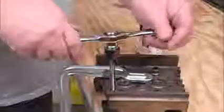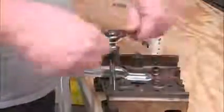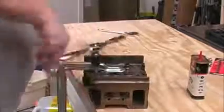After clearing the hole to make sure there's no debris in that, I can use the included tap to start cutting the threads. These taps may be cutting special threads for these inserts, but you use them like anything else. Go 1/2 to a 3/4 of a turn forward, and then back it up 1/2 a turn or so to break the chips, and keep repeating that cycle. And as we did with the bolt, once we cut all the threads, I go ahead and spin this tap down and up a couple of times just to make sure we clean everything up real well.